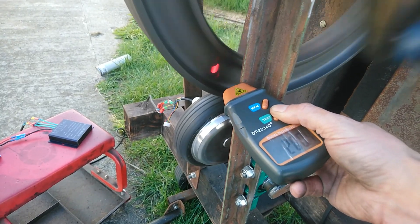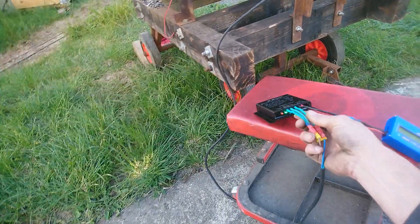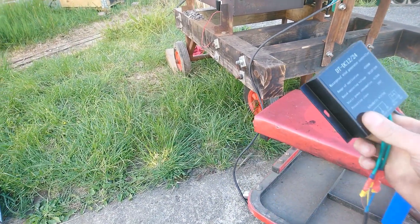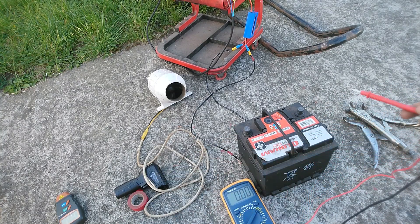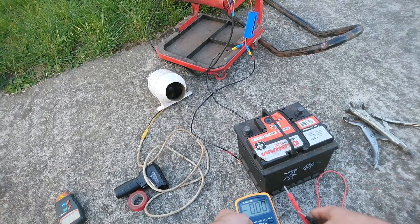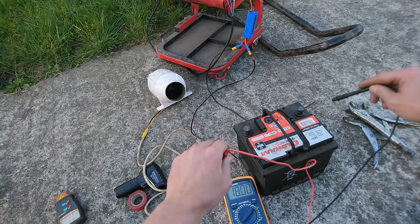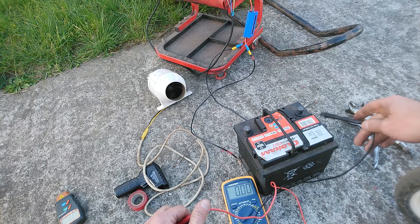The speed is 260 RPM which is actually a really nice speed. I've turned the RPM of the engine all the way down but the red indicator light is still on, indicating that the battery is fully charged, which means the dump load has been activated. This unit is the dump load — it's got a heat sink on the bottom and some kind of internal resistance that dissipates energy. Google tells me a fully charged 12-volt battery is 12.6 volts — I'm reading 12.7 volts, so this battery is fully charged. I might try and find some 12-volt items to connect up to put some load on it.